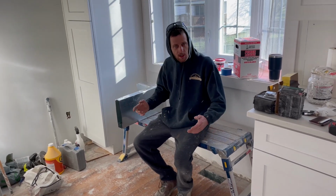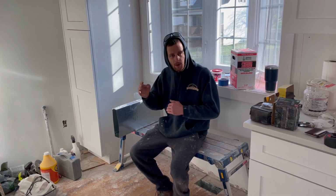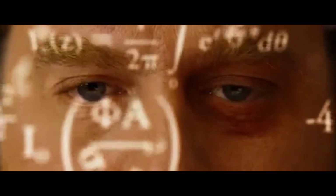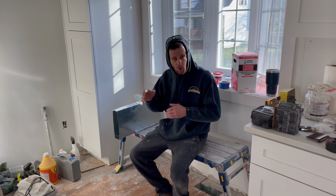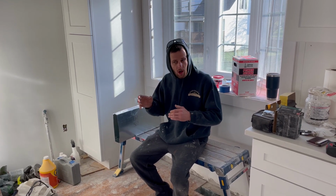Yeah. And we took a measurement of this bench, which is relatively comfortable, and the height is about 21 inches. So we figured if we use 4 rows of shiplap, which equal out to 18.5 plus 1.5 for the butcher block, it'll be 20 inches to our finished surface. So we like that one. We're going to go with that.